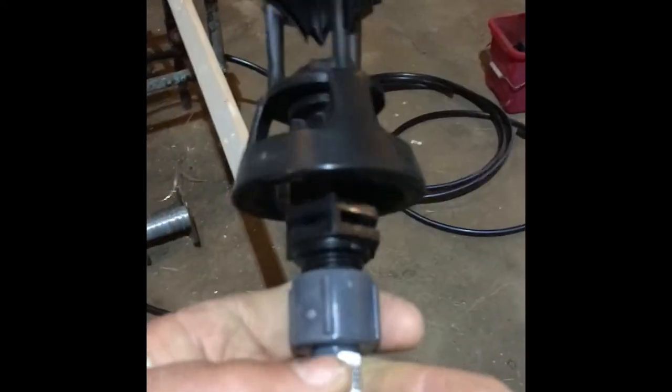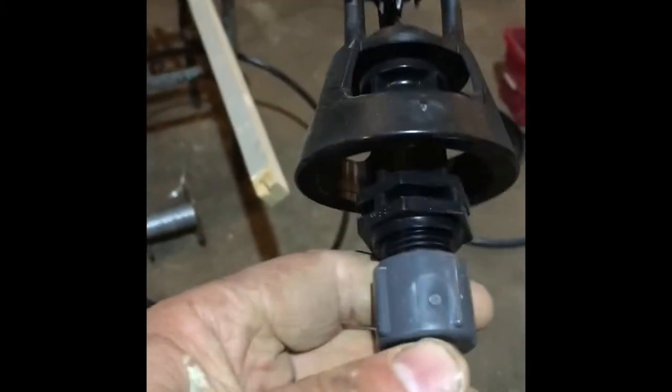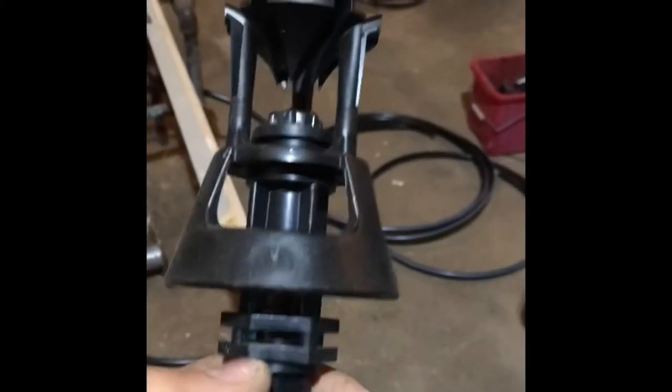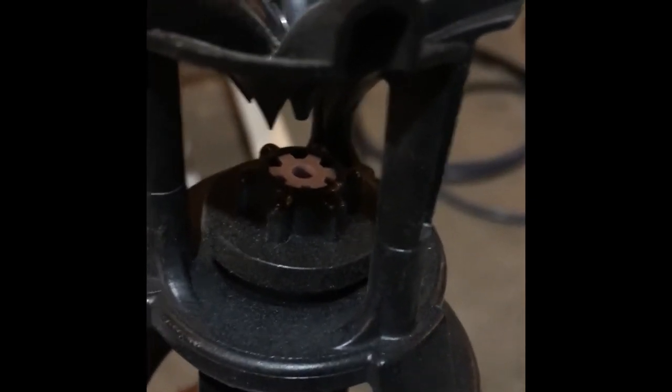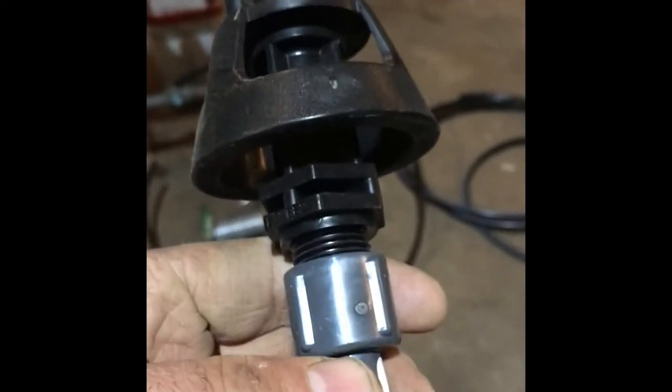My next move is to take the sticker off. This is a half-inch insert by half-inch female pipe thread, and these are the wobbler sprinklers. I'm gonna put just a little bit of pipe dope on the threads — maybe tape would be better, but I'll be careful so it doesn't clog that little lavender-colored part. Then I'll insert the fitting into the pipe on one end, and we'll be ready to attach it to our stand supports with our rebar and our ripped two-by-two.